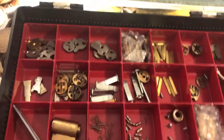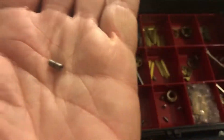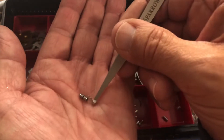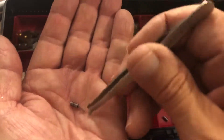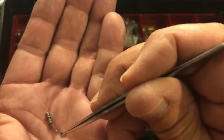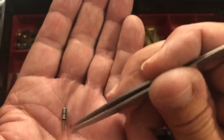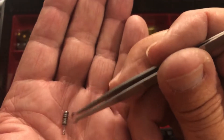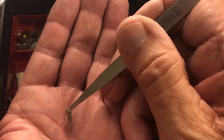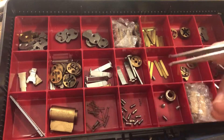There's all of this stuff to be sorted — the sidebar, these little sidebar goodies, and their springs. Every once in a while you'll see a challenge locked by steel pinnings and there'll be one of these in there. It might have a spring — people go 'geez, look at all those serrations' — well, it's an ASA twin side pin.